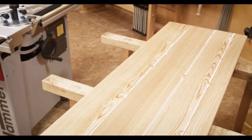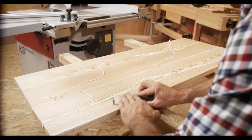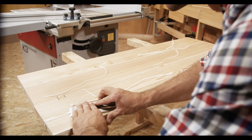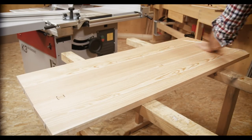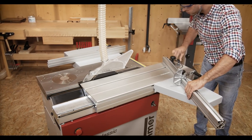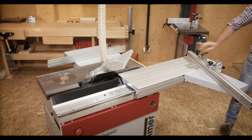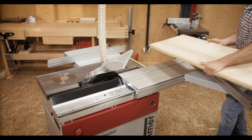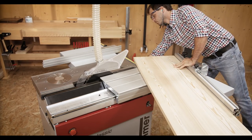Next are the glued boards, which have dried in the meantime. Dried PU adhesive is best removed with a flat sharp knife. We use a rendering plane iron. The initial points for the following cuts are the sides. These are the fixed points for all other components. This way we can counterbalance deviations from the assembly plan.